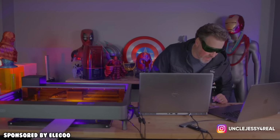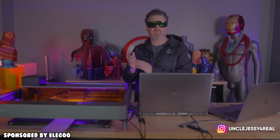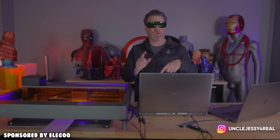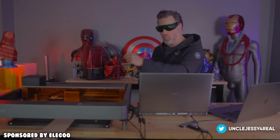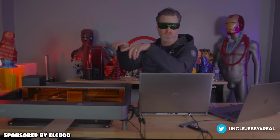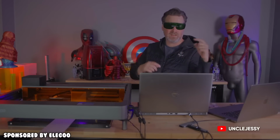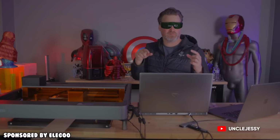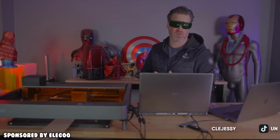Does the laser have crosshair to help with the alignment? Brian, yes. And in fact, I was playing around with a bunch of the settings in Lightburn so that I can adjust the wattage so it's super, super low. So it's not going to actually affect the object that I'm etching into at the time. And I can enable that when I'm doing some of the framing functions so I can see how it's aligning on the object that I'm trying to engrave.